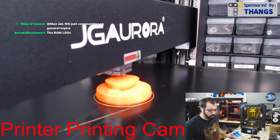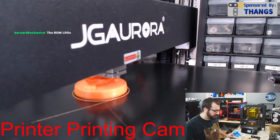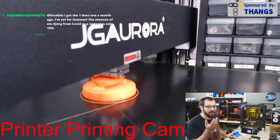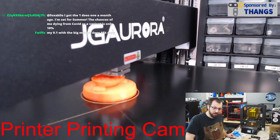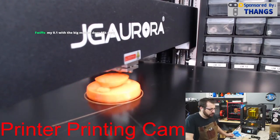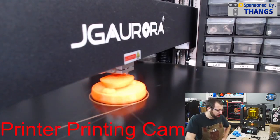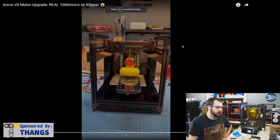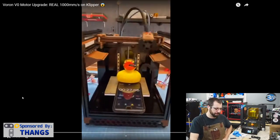The LDOs. So if you are running the... Okay, so this is OMCs. 5K is a lot. Honestly, 5K is a lot. It's 120 millimeters. Beyond 5K, I don't think you're even going to hit top speeds. Adjust motor currents. You may have to bump your currents up. But buddy right here, this is a video of somebody's printing. They are running the OMC 54 millimeter long stepper motors. This is 1,000 millimeters a second on NEMA 14s. And that's real time.